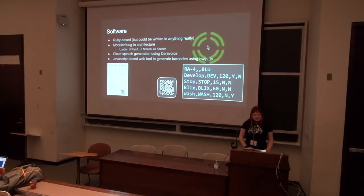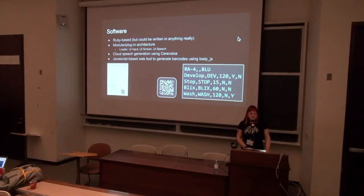I wrote a JavaScript-based web tool to generate the barcodes that get printed on each of the sheets. There's an example of one of the sheets here with all the instructions and a barcode in the corner — this is what the Aztec barcodes look like. That barcode contains basically a CSV file which says each step, how many seconds to time it for, what to display on the LCD, and a couple of other fields to indicate whether or not to turn the lights on the unit on, so if you're working on steps in the light you can actually see what's happening.